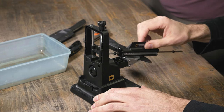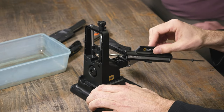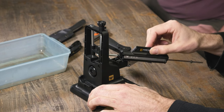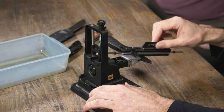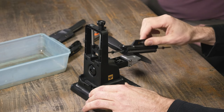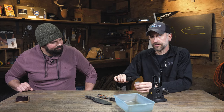You'll start to hear and feel that there's a little more lubricity and the abrasive feels like it glides across the edge, giving you that polishing effect. I like that draw stroke so I'm staying in a single direction, and that little bit of water carries on the stone and follows the sharpening as I get the ceramic across the cutting edge. It doesn't need to be a big messy process — a little dab of water can really help with your level of edge surface finish refinement as you finish on the ceramic.